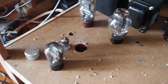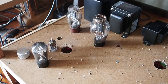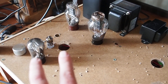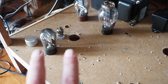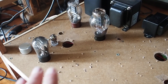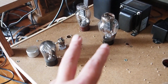The one thing to know with this amp is that the reason why this sort of fault existed and it started exhibiting strange sound was actually because what I had: I had two driver tubes that were highly insulated from the rest. They share the same rectifier tube, but otherwise they have their own choke, they have their own capacitor bank, and it's a 40-Henry choke. So they are highly insulated from each other and in general also from power variations.